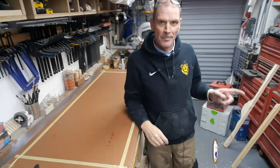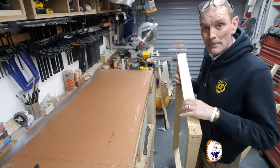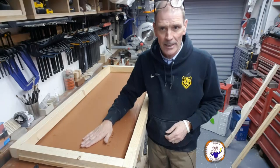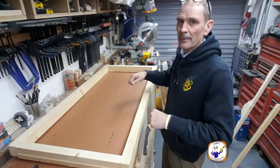My pretend live edge is sitting over here now. Let's get on with a frame for the mould of the table. I've marked it out with tape but we don't need that anymore. All I've made is a really basic frame from a couple of bits of construction timber, chopped into a square just very slightly bigger than the actual tabletop. It's a bit twisty so I'm going to screw it to this worktop.